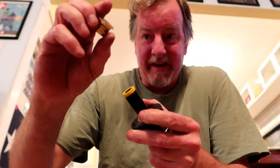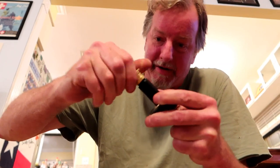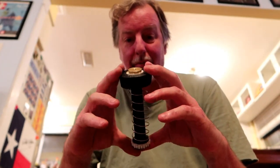What I've got is this new brass piece that's going to replace it, and this is the half-moon pattern. I just remove the little yellow ring on top. It also comes with a handy little filter that keeps any solid particulate matter in the system from getting into the head and clogging it. Then all you've got to do is screw the new head back on. Since the whole thing is brass, when it snaps back it won't ever break off. Now all we've got to do is reinstall it.